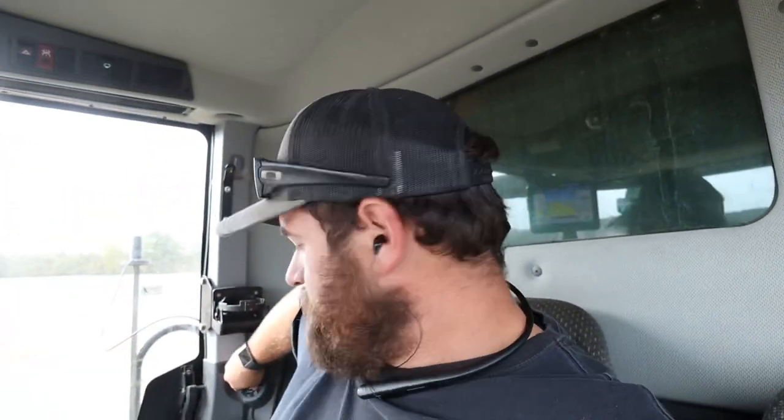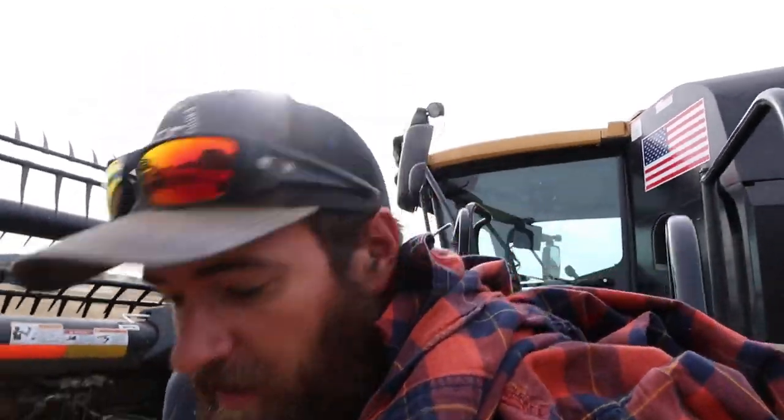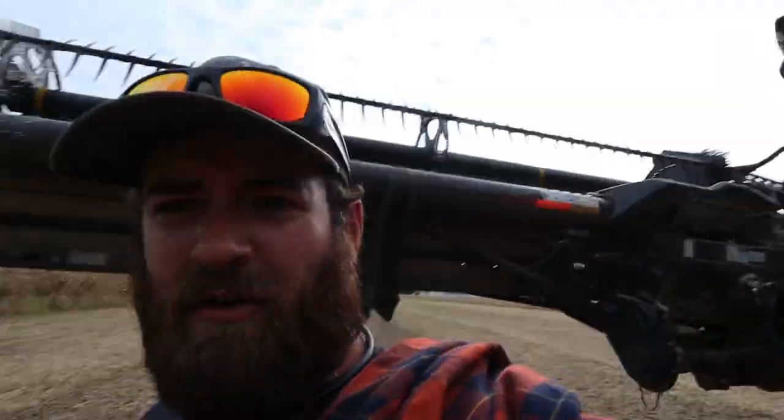Change of plans — I am going after some parts. When we were working on that belt I noticed a bearing that looked like it could be out, and it is. I ran that pass and checked it and burnt the tip of my finger pretty good. I cannot risk a fire — that shaft is extremely hot, this dust is very dry. So I'm going after a bearing.